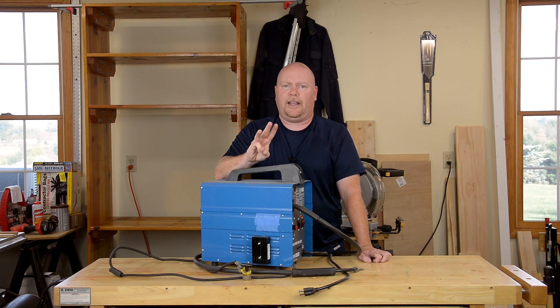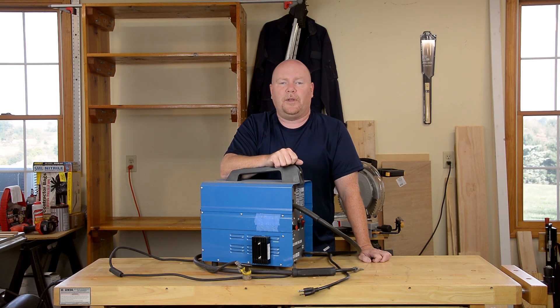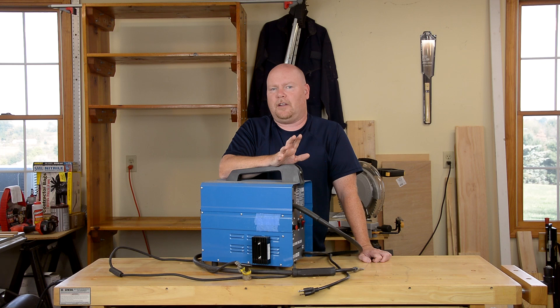The other one looks really similar, but it's marketed as a three phase AC rectifier, meaning it actually has five pins — three input pins for the three phases of AC and the two DC output pins. People ask, will this work? Can I use a three phase rectifier? The answer is absolutely yes. You just ignore one of those third input AC pins — tape it off, cut it off, whatever. The three phase rectifiers have an extra pair of diodes in there, but they all do the same thing. The three input pins are essentially equivalent, so pick your favorite two, wire it up, forget about the third one, and go on your merry way.